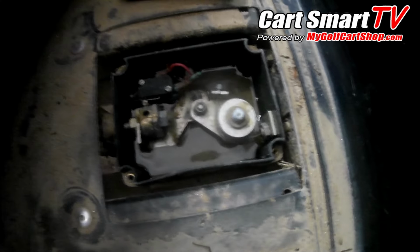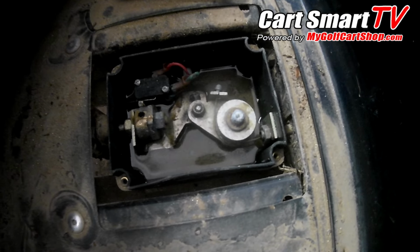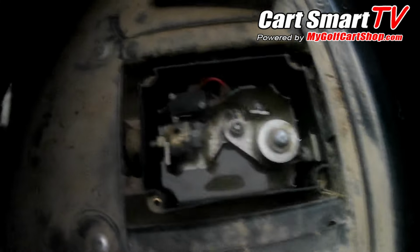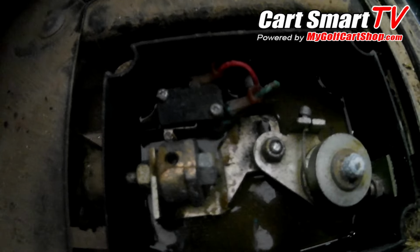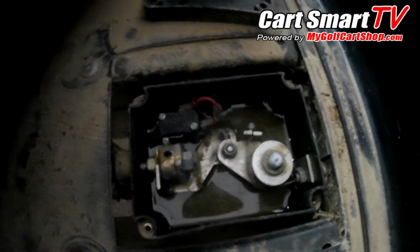but this right here certainly would cause the cart to do what it's doing and not using the pedal to activate the solenoid. It's directly driven off the key switch, because the red wire is from your key switch, so it's not actually being able to shut the system off until you push the pedal. And that's the reason why we didn't see any power up there at the key switch as well.